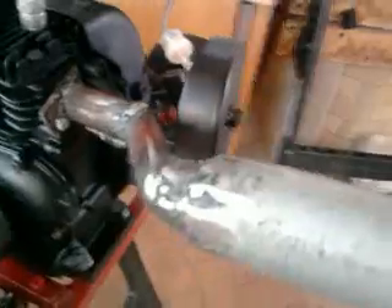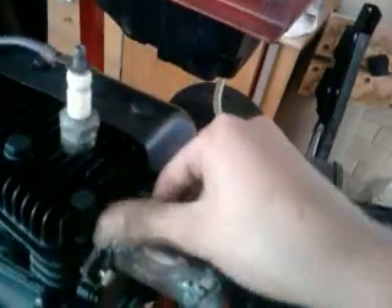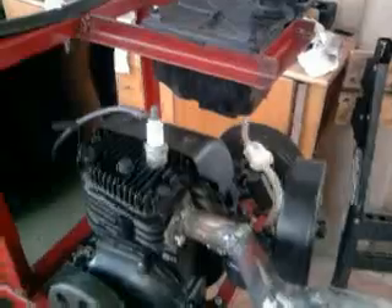From that angle, just imagine that flying down the street. Brendan V commented on my old video that I need support, so I'm just going to trust them and put some support. I'll put some really strong welds around here — it's not that heavy, so I reckon the welds could hold it, but after thinking about vibrations and going down curbs, I really don't trust that. So what I'm going to do — you can see there's like just the indent there — I'm going to get just a pipe and weld something there to go down and just rest on there, and I'll put like a soft end or something so it can't really go down. Even if I push down, it's not going down.